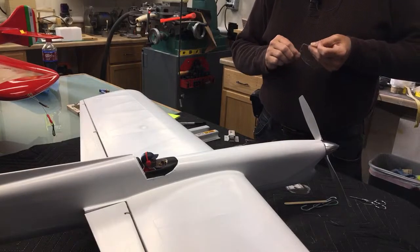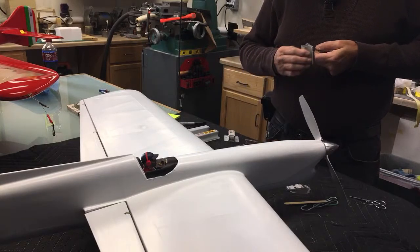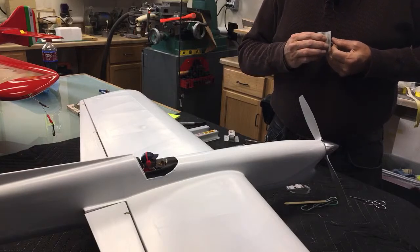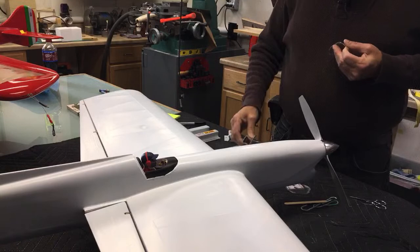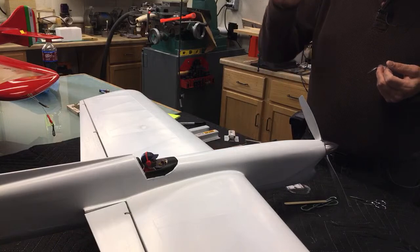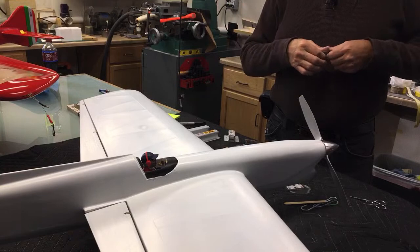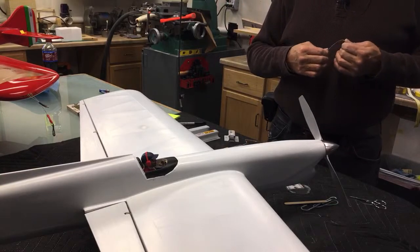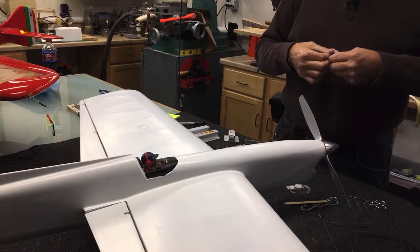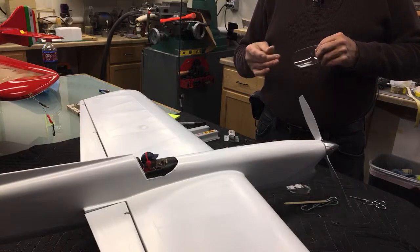How much is your total finish on this, do you think? Total finish? 6 ounces so far? No, complete. I don't even have my first quart of thin dope used. I still got that much in that bottle. Don't use it if you don't need it. Well, I know, that's what I mean. For a 6 ounce finish, you're using 2 quarts of clear. And if I don't use that, I still got my quart for the top coat.